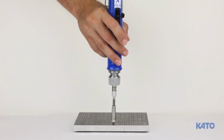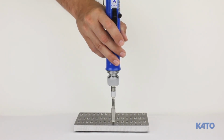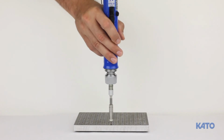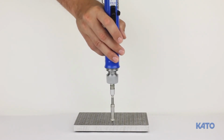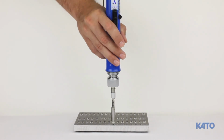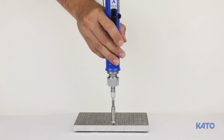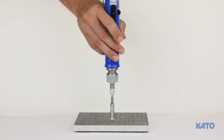It is very important to remember this is an auto-reversing tool. Once you press the trigger, do not release it. After the insert is installed, the mandrel will bottom out and cause the electric driver to reverse. Continue to hold the trigger until the mandrel exits the installed insert completely. Releasing the trigger will reset the tool, and pressing the trigger again will cause the tool to turn clockwise.